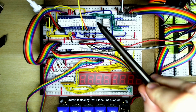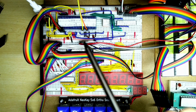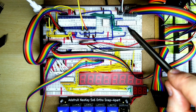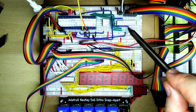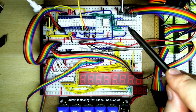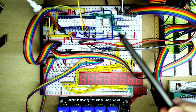So the problems I was talking about earlier to do with the interference on reset, what I'm now doing is taking the active low reset from here, feeding it into this side of the PLD and making use of an unused pin here to generate the active high reset, because this doesn't seem to have the same sort of problem. So most of the problems I've had causing delays were related to the interference on this, and I'll show you some captures from the oscilloscope to show how that has changed. Other than that, I think everything else should be the same.